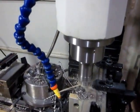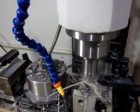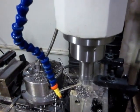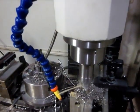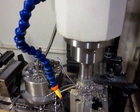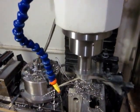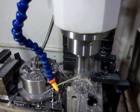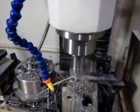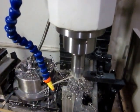It's nice drilling upside down as the chips want to fall out, making cooling a little easier. When I go ahead and make a manifold block, I may actually try to create a way to feed coolant into that block so I can easily put coolant right up inside the bore. The chips don't look hot. I found that the pecking cycle helped to break my chips up so I didn't have any chip wrap.